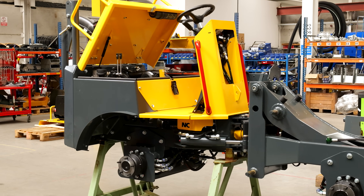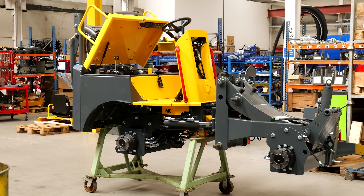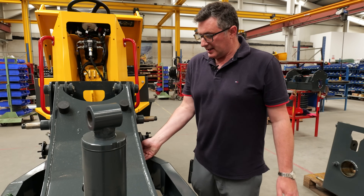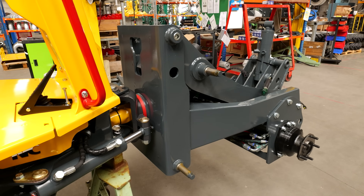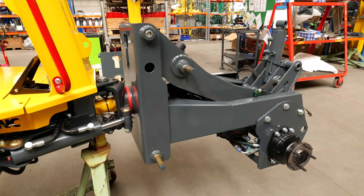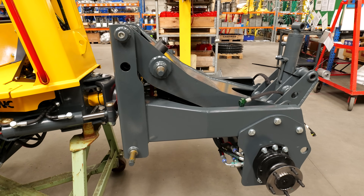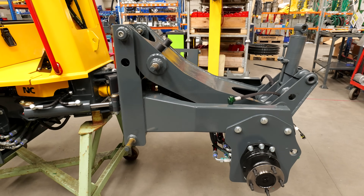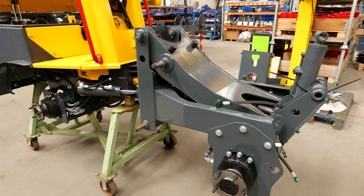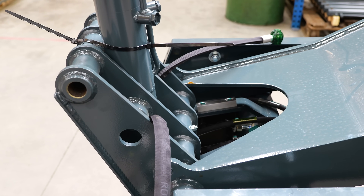This is stage three. We put the front chassis in, slide the bearings in over the cast pivot and slide this chassis on. We put the wheel motor box on, and we've got our high-lift frame here. The parallel linkage underneath keeps the whole mechanism parallel as you lift the skip up and down. The biggest challenge when designing this type of mechanism is getting enough lift and the correct tip height — the geometry and getting all the strength into it in the right places.